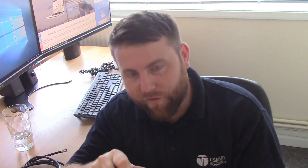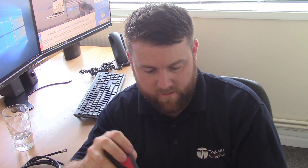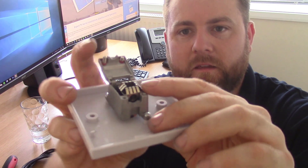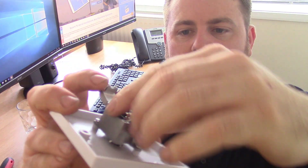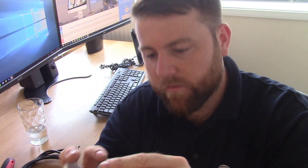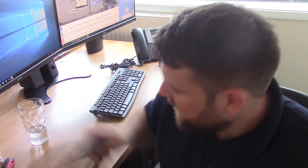Sometimes where the wall plates don't match it can look a bit off, especially if you've got rounded-edge plates versus square ones, or where the whites differ - it's amazing how many different shades of white there are. So let's open this one up. Inside we've got the wall plate with a little screw - same sort of idea as the other, except this one's in a metal housing so it's screened, which is much better. It's also much more important nowadays to use screened cables.